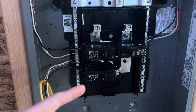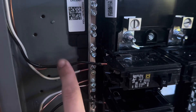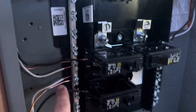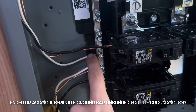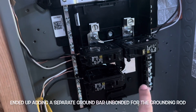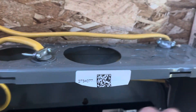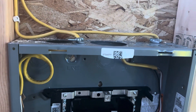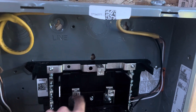The breakers I couldn't really do while I was recording — it's just kind of complicated. But I'll show you that the black wire, which is the main power wire, runs into the back of the fuse at that screw, and this clamps down on the wire. The ground wire is the bare copper wire, and the white wire is the neutral wire — they both run into the grounding bar. I repeated that for all three outlets, which you'll see where they run to further on in the video. I also used clamps, like I'm supposed to, for all these holes. This is where I'm going to run my main power wire through for the three mounting spots.